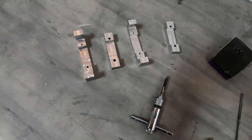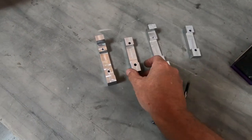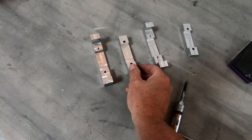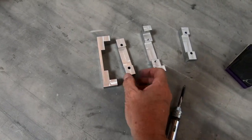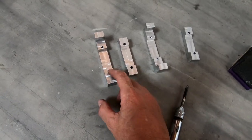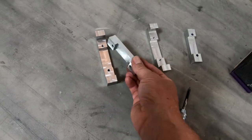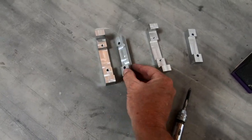All right, my welder wasn't available today. He's not going to be available until after the weekend. So I went back to these fittings, or these clamps for the gear leg, and I went ahead and drilled and tapped the holes in here for the quarter-28 bolts that I'm going to use to connect the top and the bottom halves of these clamps together.